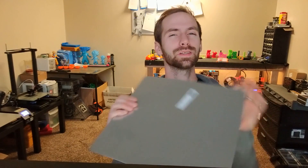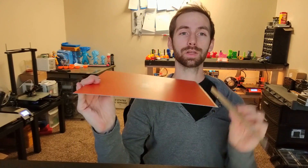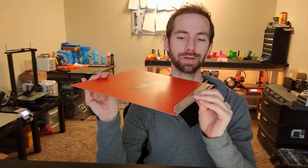The Lokbuild comes with a sticky back on it. After I cut the sheet steel to the square I needed, I just took it off and stuck it on. This bends fairly well — probably good enough for what I needed, but we'll see. My first thought was to skip magnets and just use clips. I didn't think a clip on each corner would be sufficient, so I bought some aluminum bracing to clamp down along the edges for better surface coverage. After printing with it a couple of times though, I realized that was overkill — clamps on the corners worked fantastic.